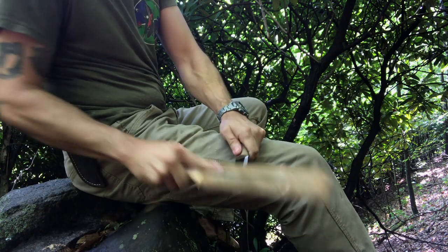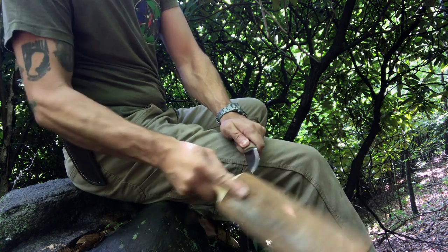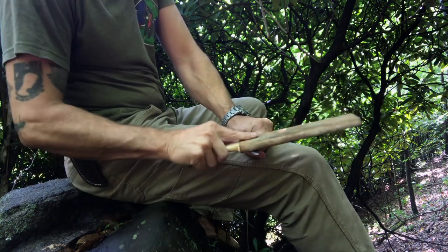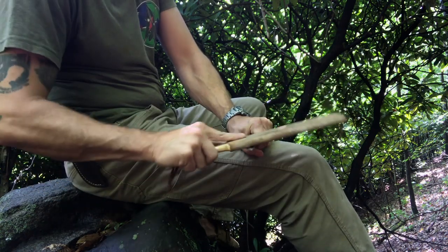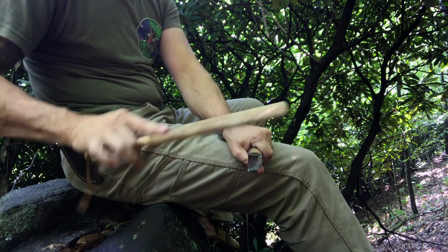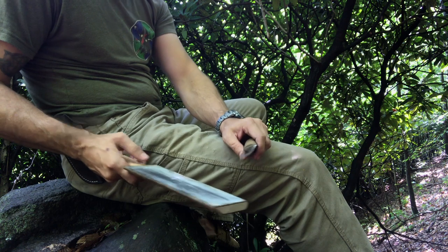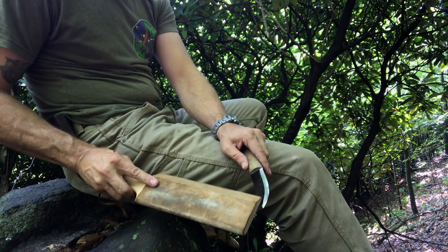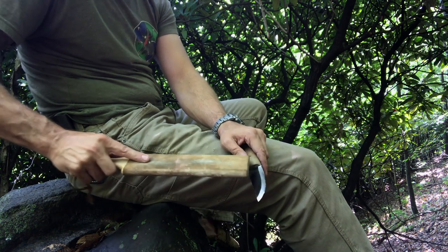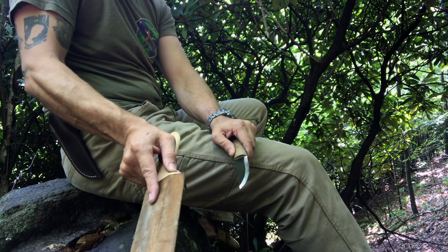So I can go 10 strokes on one side, and as I'm pushing away from that edge I'm also going along that contour. As I get towards that tip, it's very easy for me to feel when it starts to come off and turn the paddle to follow that curve. I'll do that slow a couple of times, then flip it over and same thing — drag it towards the tip, turning as needed to stay along that edge. A lot of times this is faster for me. The key is to keep the knife as stable as possible and to stay on the contour with the paddle. For folks having a hard time especially up towards the front side of the blade near the tip, this may be a good technique. I find it's a lot easier to stay on that contour when I can turn the entire paddle to follow it.